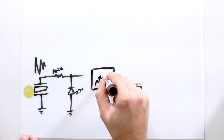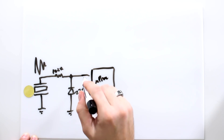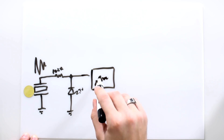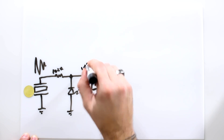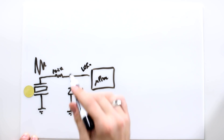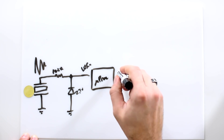Of course, we have eight of these. Any time we get a pulse, the microprocessor will detect that with an interrupt on change, so that needs to be set up in the firmware. Any time that signal changes, it says a note has been hit — let's figure out which note was hit — and then we need to change the PWM signal at the output.